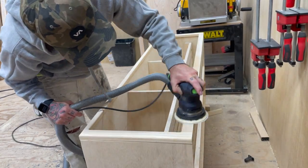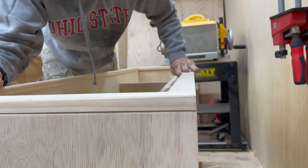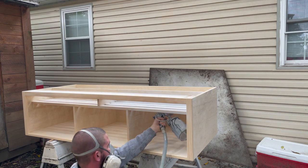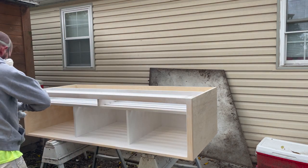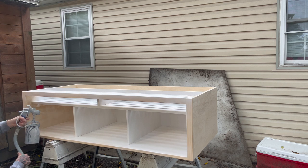And as you can see in these next couple shots, before I put my face frame on, I rounded over the piece of plywood, which is actually the carcass of this, because you're never gonna be able to line that face frame up perfectly. So if you purposely make a line between that, which I call a shadow line, it just makes it look a little bit nicer. And if you do have a gap, it kind of hides it a little better.